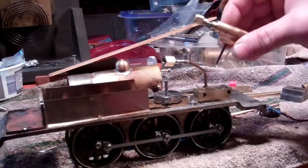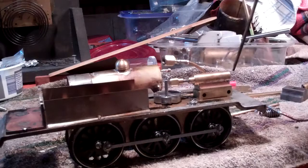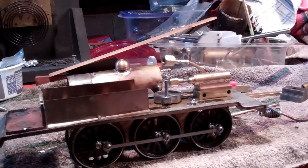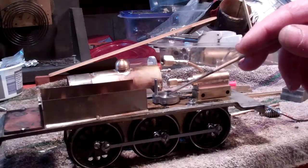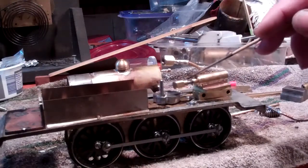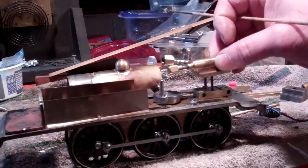When I made the pistons for this, the first piston setup I had was a single action piston, which pushed and then the stored energy in the flywheel resulted in the return of the piston. I wasn't happy with the way that ran, and I also had the stroke too long. I wanted to get some torque out of this, but I've since reduced the stroke and converted this to a double action cylinder, which pushes and pulls at the same time.